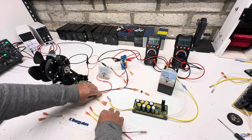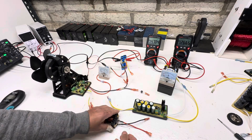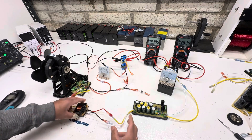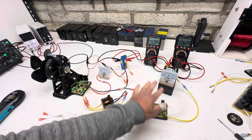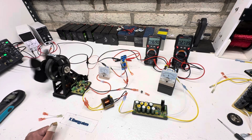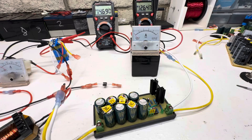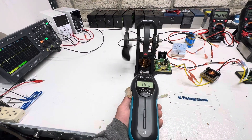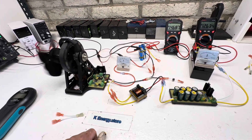Usually with the transformer it goes in series, yellow to yellow, but in this motor's case I'm going to direct-short it across the output. None of the other motors I have can do this without tremendous power draw, so it's kind of unique. Now we're directly into the transformer and the output is completely isolated — we could go back to either battery. We're now using 100 milliamps, barely visible on the scale, still pulsing into the second battery. RPM is 590, almost 600.